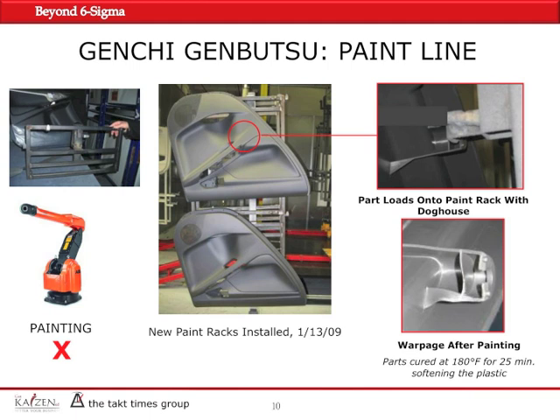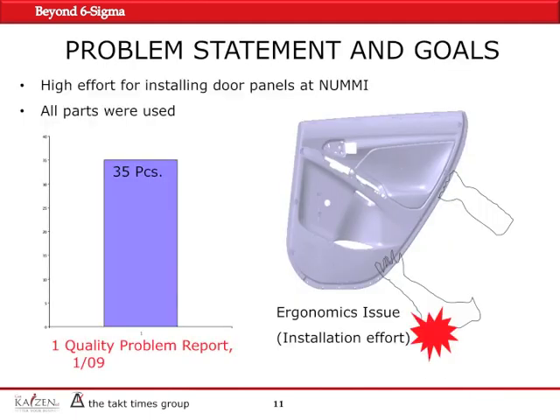As you can see, the door panels are hanging on the rack. This is how we secure the door panels so they don't fall. As a result of the heat and time in the oven, this is how the dog house would deform — almost every single case on the rear door panel Model A had this situation. This close-up shows how the dog house was defected: the leg supporting the dog house was deformed very badly, causing the door panel to sit lower or higher than normal when assembled to the sheet metal at the customer site.